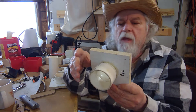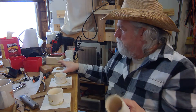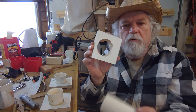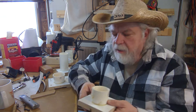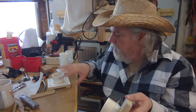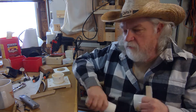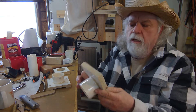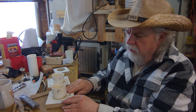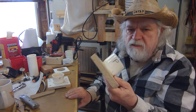Looking at the upper piece first — it's basically five by five, but you can make it any size you like, and I'm using standard PVC pipe. When I take my piece of melamine or whatever you're using, I drill the hole just the right size for the PVC pipe to set in there. Then before I put the piece on, I heat the pipe up with my heat gun. When I get it good and pliable, I take a straight piece of pipe and shove it down in there so that it will fit two-inch PVC. So if I'm using two-inch PVC duct work in the shop, I can hook these right up to it. Once I get it swelled out and cut to length, I set it in and hot glue it in place — that's more than enough to hold it, and it holds very well. I haven't had one come apart doing it this way.